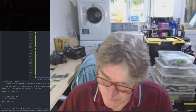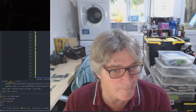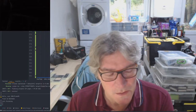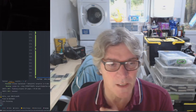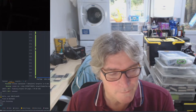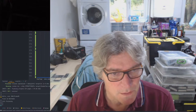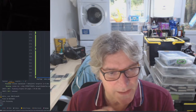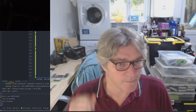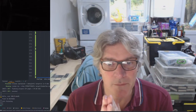I decided to, because of the problems with the hum or buzz on the mic, take the cabling and the mic apart. The mic connectors look fine, but I cleaned them all with some alcohol. And then on the connector, I cleaned the inside of the contacts of the XLR connector as well with alcohol. Hopefully that solves the buzz that we've had.